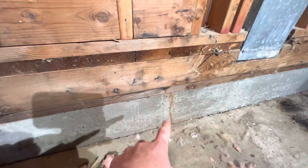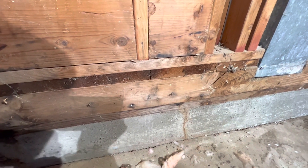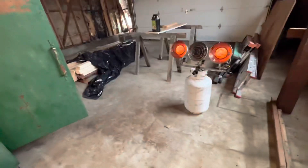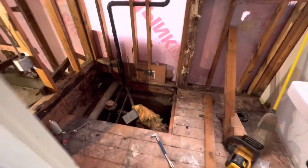I've got the floor ripped out. It's all termite damage. The pest guy came out because I saw some tubes here — I actually destroyed them; I thought they were cracks in the concrete because we were looking for the J-bolt locations. Came over and saw it knocked off — it's a termite tube. Nothing active, but it's there. We had Terminex — or whoever it is — come out and they're going to treat this place. For now, we've got the floor pulled up, and that's where they were feasting.